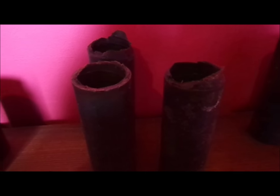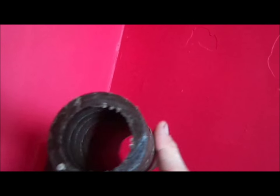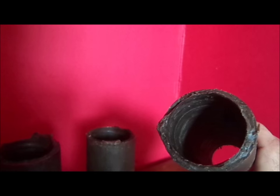If I can locate the original procedure that was used at Edison's factory around the 1890s, this is precisely how the records were made. You have an oversized blank that comes out of the mold, and the reason is to compensate for any changes that the wax may do. You have a better chance of having a good blank come out of the casting. Half of the wax goes back into making more cylinders. Each cylinder then subsequently makes half of another casting or a whole cylinder. It all ensures quality.